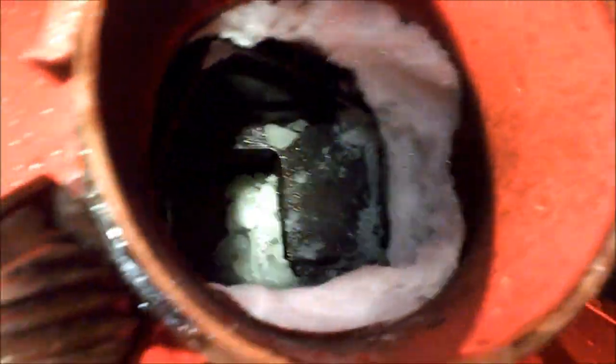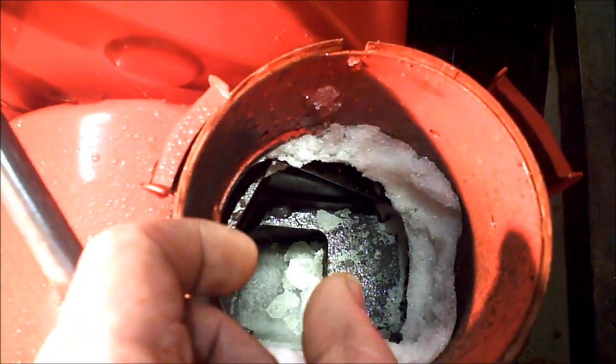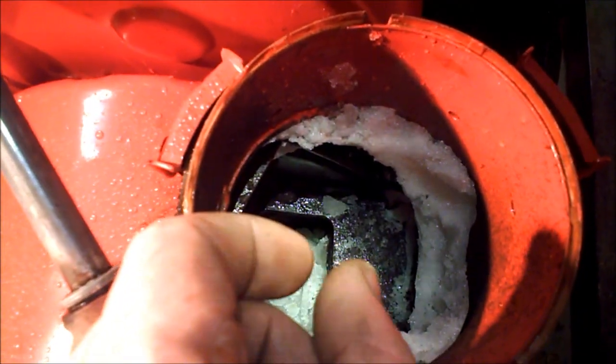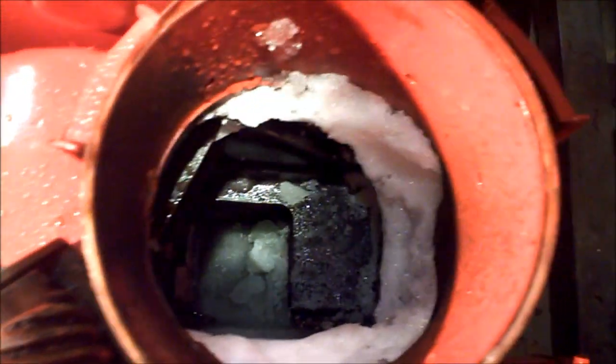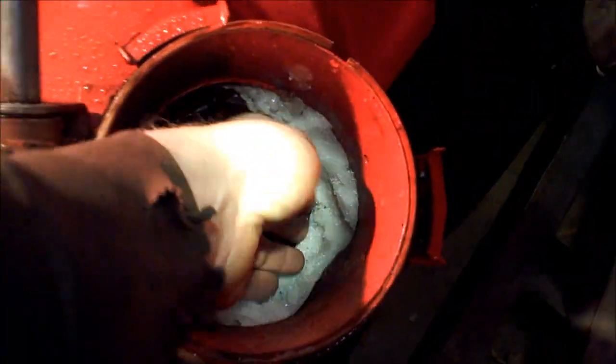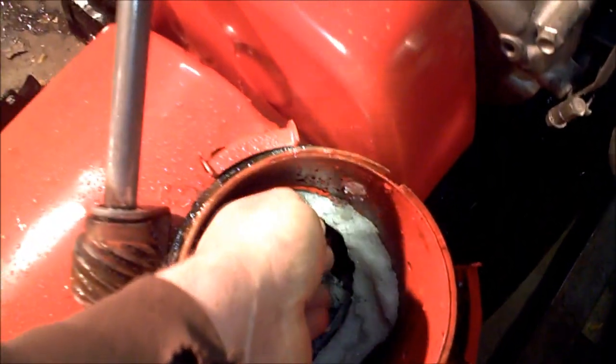They built in a clearance — I've seen it as bad as half inch, maybe even five-eighths, down to about a quarter inch or so on most of them. Even with that, you can see in this one that the snow just ices up around the edges. It ices up around the edges and the snow sticks to it. So any fresh snow that's going in there sticks and has something to build up on, forming a continuous ledge.